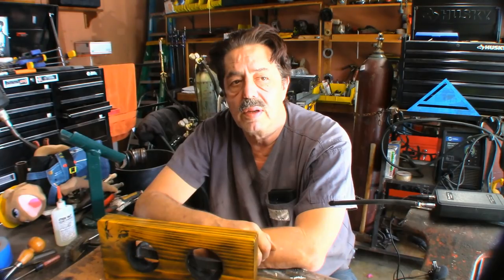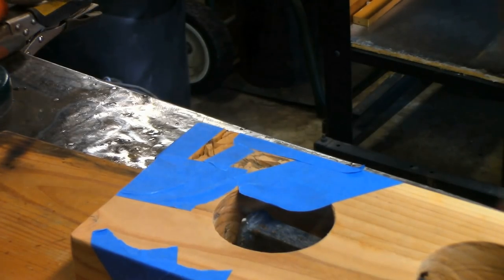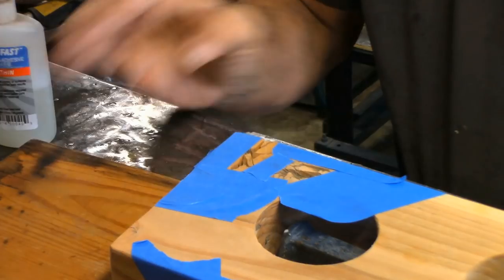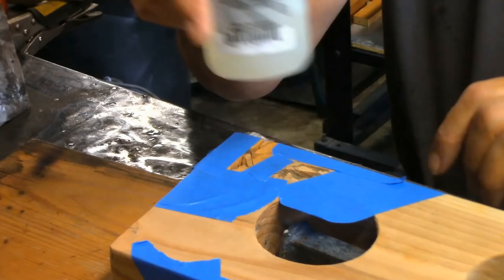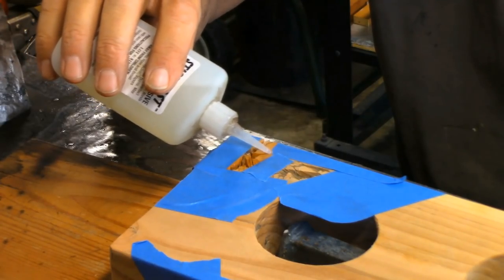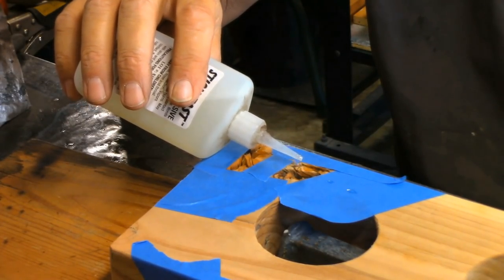We have some bad craters and divots in this wood. Get out some blue painters tape and mask off all around the void so you don't hurt the finish of the bare wood — the glue can bleed through to any finish really easily and sink down deep. I use CA glue — either Stickfast or Star Bond, I'll put the link in the description. I pre-fill all my voids with the CA glue, being as careful as I can not to let it bleed onto the bare wood.